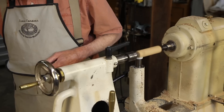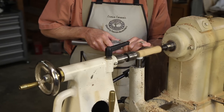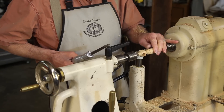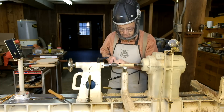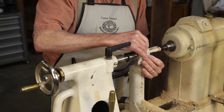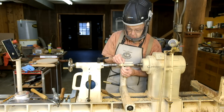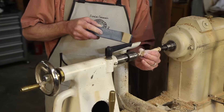The main tool we'll use here is a spindle gouge. We're getting there — we can close in on the bowl a little bit. Our final thing here is to sand this with some 120-grit paper. This boxwood turns so nicely with sharp tools that we have very little sanding to do. We'll take a block of wood with some sandpaper and create a nice little flat spot all around the edges.